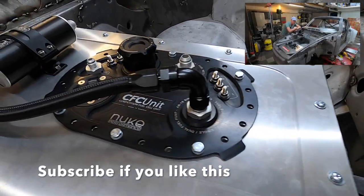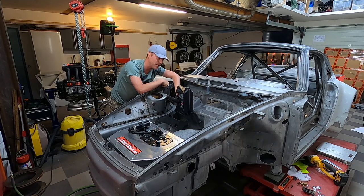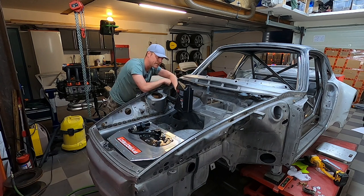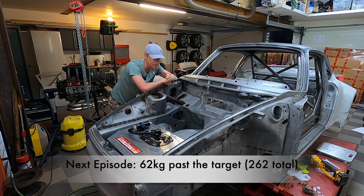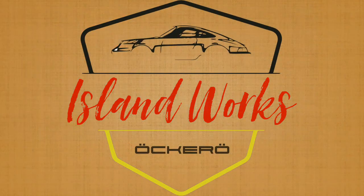This also enables a future project: relocating the oil tank up to the frunk, which is worth another approximately 1.5% in weight distribution. Having the oil tank closer to the engine and slightly higher gives a bit more head pressure in the tank, making the whole operation safer. That's going to be one of the future episodes. For all of you watching, thank you very much. If you like what I'm doing, subscribe, write a comment, like the video. Next time we're going to do something else crazy — I'll see you then.